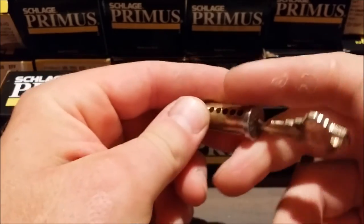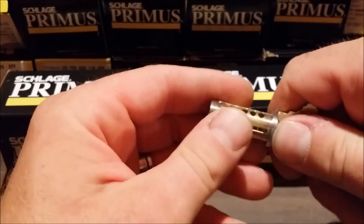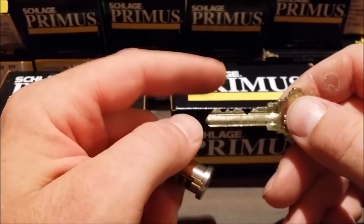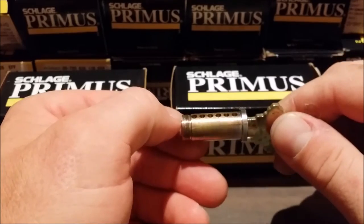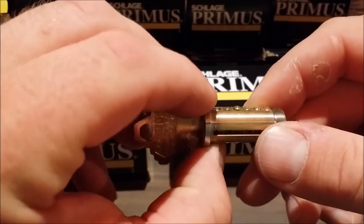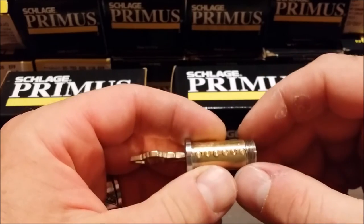Now we've got our key to work. Sometimes they're a little bit tight - usually running them in and out a couple times will help loosen them up. This is a brand new plug. Now that we've got the key to work in the cylinder, we've got another hurdle to jump over - and that is pinning it. I don't know if Primuses have a different pinning kit than standard Schlage, but I actually have a Schlage pinning kit. For some reason the pins all stick out just a hair past the shear line. I'll show you one all pinned up - I tried to show you in the last video but you couldn't really see it. With this one I went a size smaller and it was too short. So these all have to be filed down. I'm going to show you how I was able to create a shear line out of a bunch of mismatched pins.